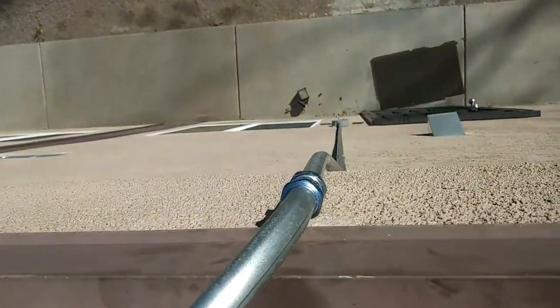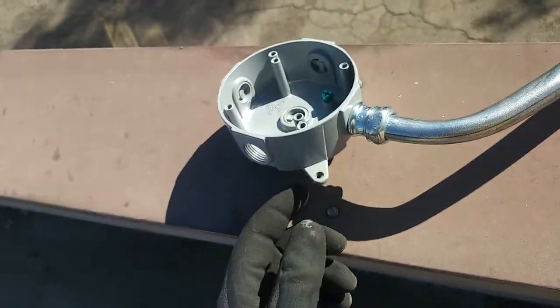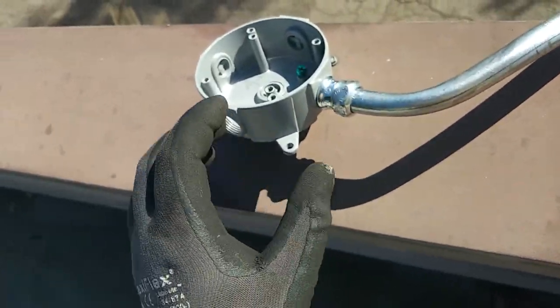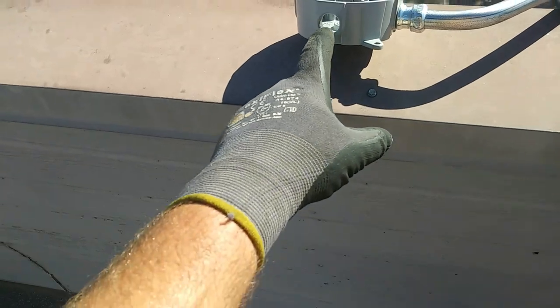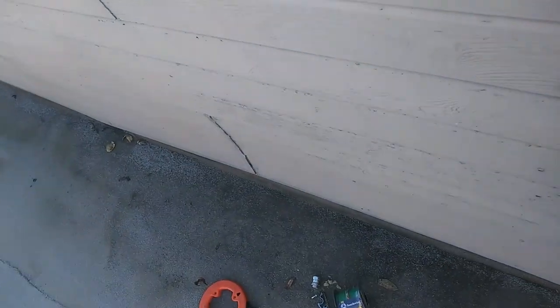In this clip I had way too much wind noise so I'll just have to voice over here. I did a pretty basic offset to get up over the little stucco difference there, and then kind of a more complex offset. I forget exactly what the angles are but they're kind of funky — it took me a couple tries to get it exactly right. I think I wasted one little scrap of conduit. I did set that box up there intentionally, which is why I had to make that funky bend so we could get the angle we wanted on the LED flood lights.